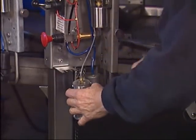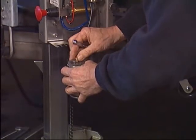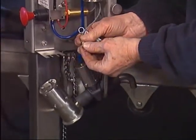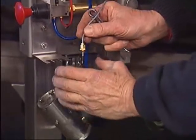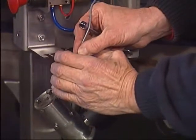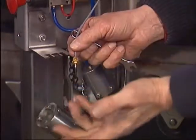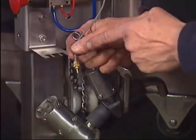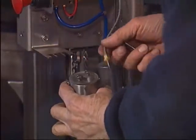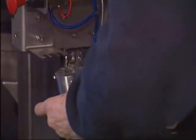To test the whisker valve, reconnect it to the gray hose. Get a small styrofoam cup with water, put the switch on automatic, and put the whisker valve in the water. If it's leaking because it's worn out, you'll see bubbles. If you do see bubbles, take the whisker valve out, throw it away, and put a new one in. Now there's a trick to this — it's worth taking the sensor apart to show you something. Disconnect the sensor from the circuit to make it easier to work on. It's easy to work on when you have it in your hand — use a quarter-inch nut driver.